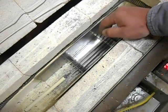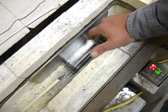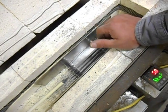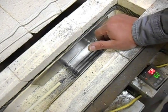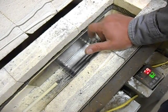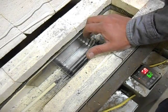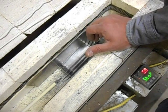This new one, the new baffles and the new blade holder, are made out of some steel that I got down at the steel yard. It was in their scrap pile, so I don't know what kind of stainless it is, but it shouldn't scale up the way that the carbon steel that I have been using does.